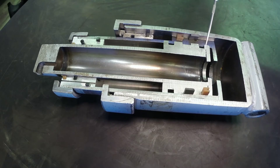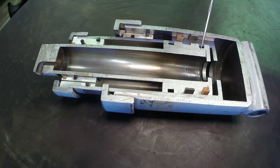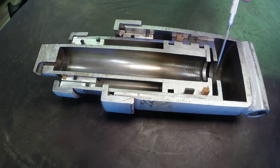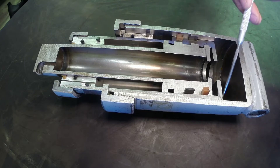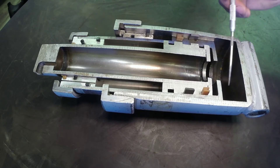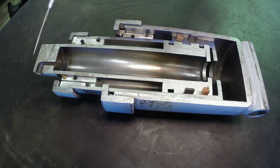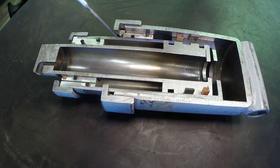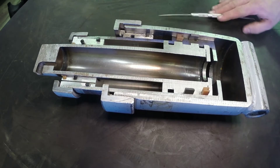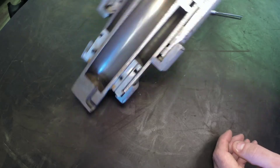Because this is essentially two cylinders in parallel with equal pressure in both of them, the greater force will be created by the large first stage of our telescoping cylinder. That's simply a pressure times surface area calculation. When the force is enough to overcome the load — often these cylinders would have this be the bottom end and the barrel would be the top end — to save contamination from getting in past the seals, it would basically be mounted in a vertical condition.